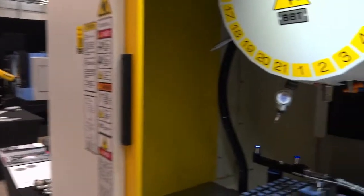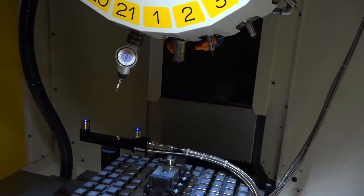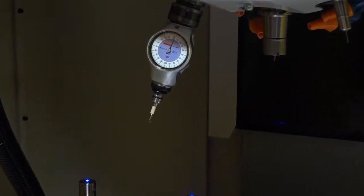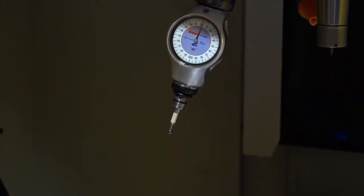So Andy, what is it like doing micro machining? It's fascinating. It takes your level of precision and attention to detail to another level. You've got to have everything absolutely spot on to drill these holes right. And obviously, you can see in the machine, we've got the Renishaw laser probing. So what's that actually being used for? On this, we've got the Renishaw NC4 Blue. It's a special purpose laser for checking tool lengths, but we're using it in this application for tool breakage detection.